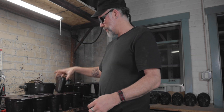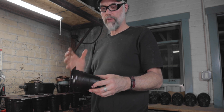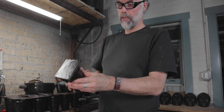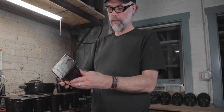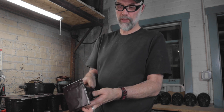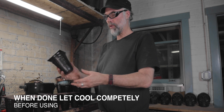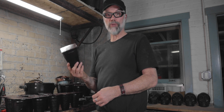So there we go — a series of two dips, a button, two dips on the bottom, two dips on the top to seal the lid, and two more seal coats. Now we have our wax cups. Try to be as clean as possible with the least amount of drips, but you will get a few. If you catch them while things are still warm you can flatten them out while the wax is still soft. That gives us a nice foundation to base the rest of our gating and sprue system on. Our pour cups are ready to go, ready for our patterns.